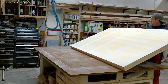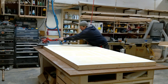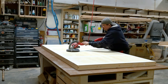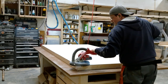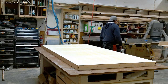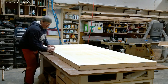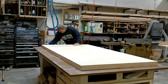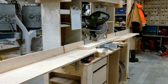The filling is done. It's the next day — I'm a little over-PPE'd because I was using my chainsaw earlier. This is a drywall sander; I got sick and tired of sanding mud with a palm sander, so I bought a cheap drywall sander and just sand the mud back — it's really quick and awesome. There's a little bit of mud over the edge, so I use a foam sanding block to get rid of the excess. Put as little drywall mud on as possible, and there — it's filled and done. I've done that to both flats.